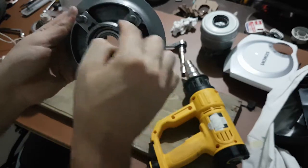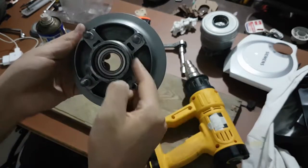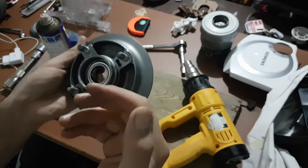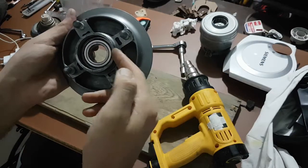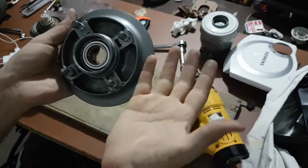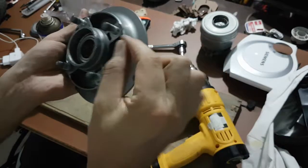What I was doing wrong: because I was using a heat gun and not a propane torch, I was thinking the heat I was applying wasn't enough. But actually I was applying too much heat for too long, heating everything, which means everything is expanding. So you should use high heat for a short duration, and it should be focused.